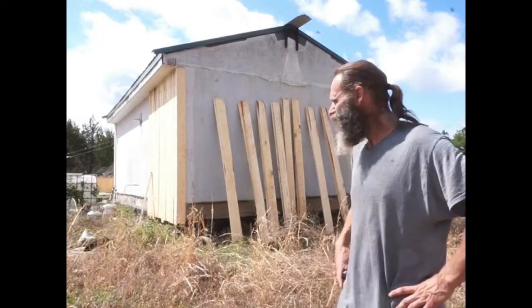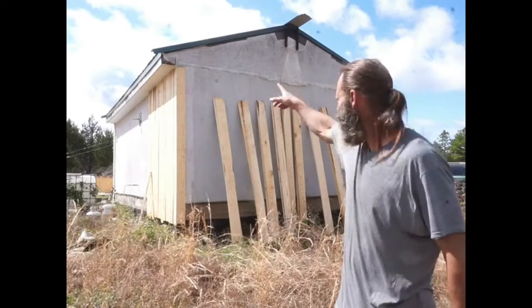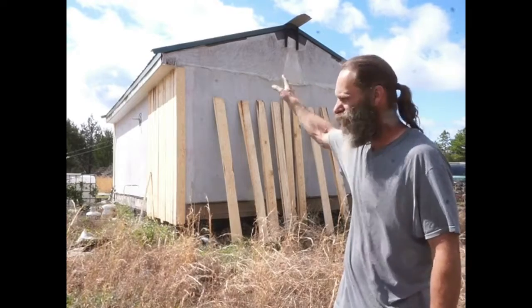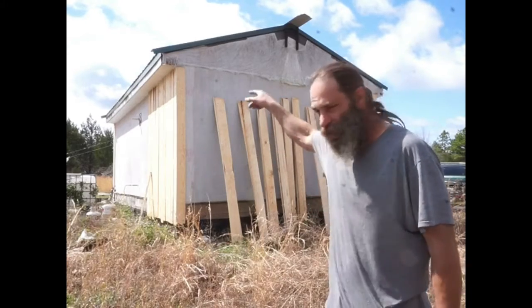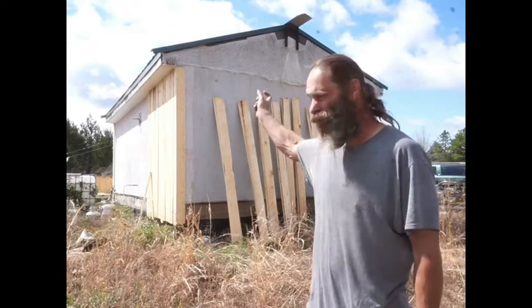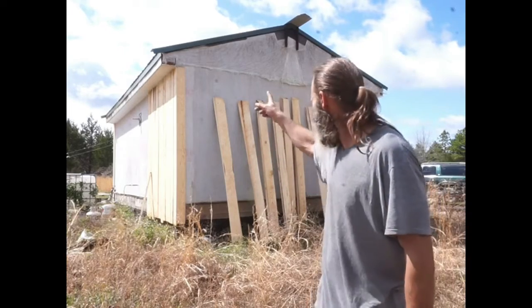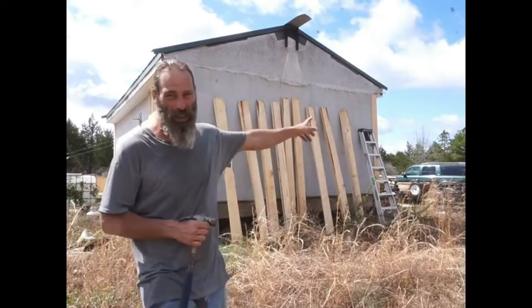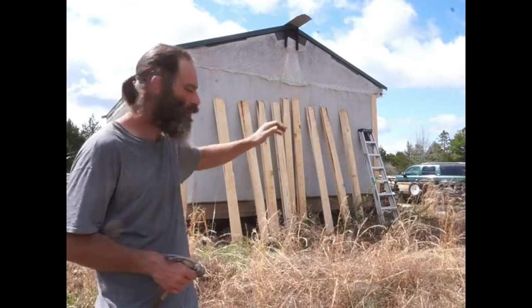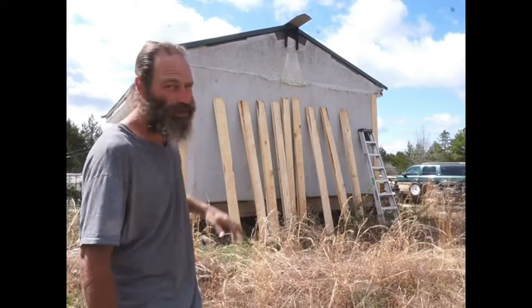Well, I made short work of that little stack over there. So this side I'm going to do like I did the front. I'm going to basically try to extend a beam from this side to that side of the house, and it's going to extend onto the awnings because, like I said, I don't feel like cutting anything with the saw just yet. So I'll just fill in the little leftover pocket. There will be a leftover pocket on one side or the other, but the boards are long enough to stretch across. The trick is going to be getting it level and lined up from this eave to the eave over there, so that I've got a straight board running across, and then I can just take these guys and butt them up right against that and use that as a baseboard for whatever I do for the gable. Probably going to be some cussing involved here.